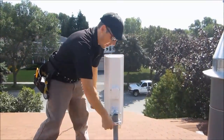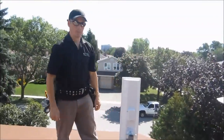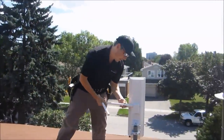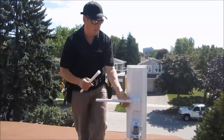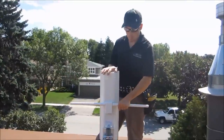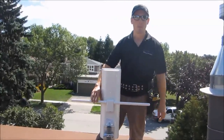We'll do some adjustments and then tighten these up with pliers. We'll put on the side arms — these are for picking up the VHF side. In the Toronto area, Channel 9 CFTO CTV broadcasts in VHF. The main antenna is a UHF antenna, which the majority of channels broadcast in, and then these side arms are for VHF channels 9 and 11 in the Toronto area.